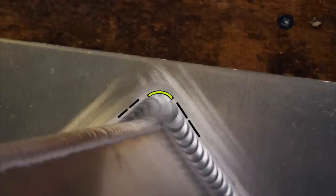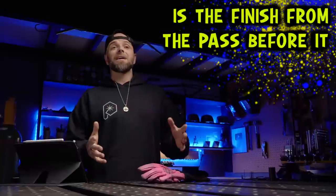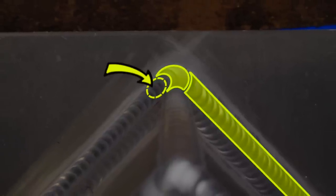When I'm welding around a corner like this, I actually tend to think about it as if I'm welding around a little semi-circle instead of a sharp corner. We are going to take extreme care to turn around this corner carefully. As I am traveling around the corner, I'm trying to keep the profile on the bottom line of the bottom plate, and I am now terminating the wrap on the exact opposite place on the corner where I did my last termination. Each time whenever I finish one of these welds — whether on a straight pass or a corner — I'm essentially planning to put it in the exact area I need it to be, so it creates a proper setup for the weld that comes after it. The thing that determines how the next pass goes is the finish from the pass before it. I've taken the time to set up a perfect pocket of welding that I can start my next pass from.